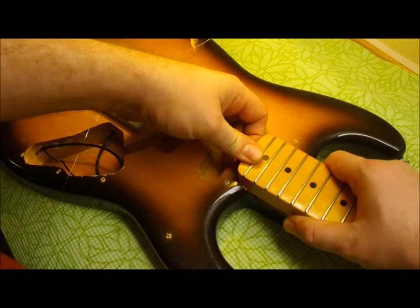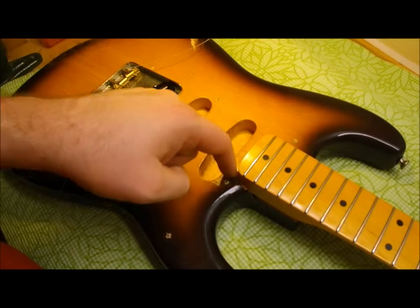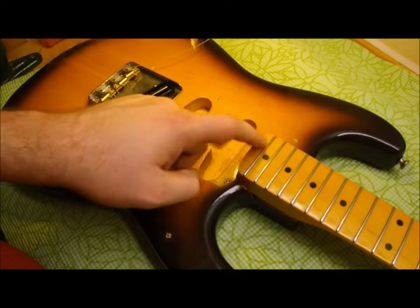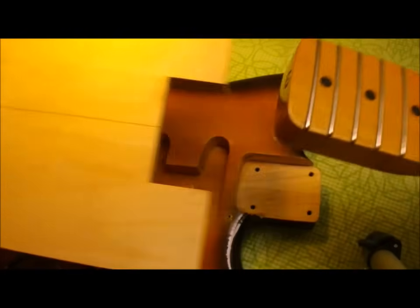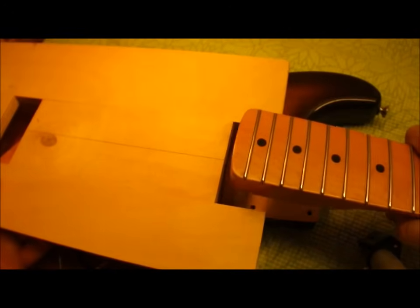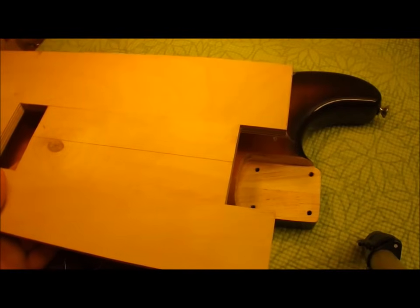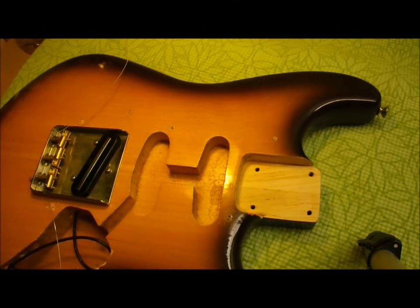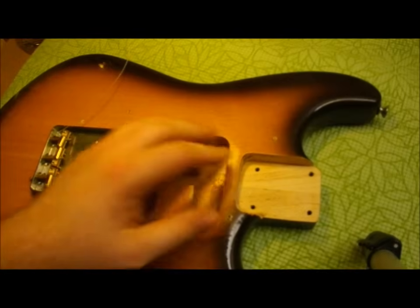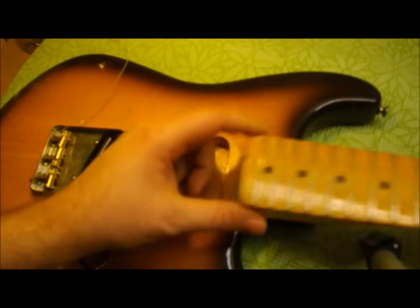So that's really tight, and you don't want to force it too much because the wood is rather unsupported — this is vertical grain pine, you could easily crack it right there. So I don't want to push this in too deep. Now the fit is really close though. If it wasn't, it might be more advantageous to make a router jig using some half-inch plywood, surround the neck, make a template, clamp that in place and route the material down — which is what I'd normally do building a guitar with a set neck where I was going to glue it in. In this case, I think all I really have to do is remove a little bit of material on both cheeks on both sides to get it to fit.